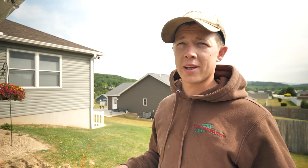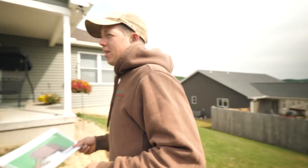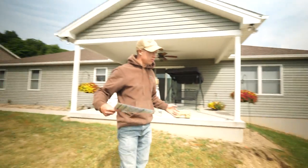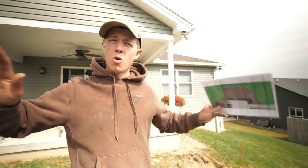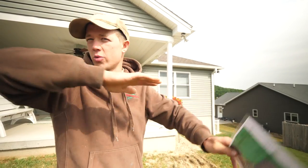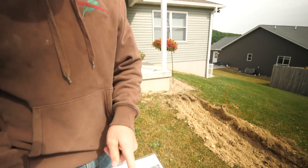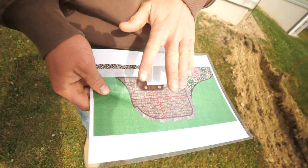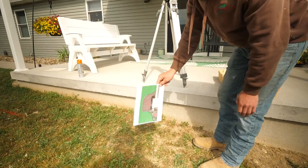If your yard is like most people's backyards, it's not nice and flat, so you're going to have to make a space to put in a patio. A lot of the yards we work in look like that — there's hills in them. In this case, it falls off steeply here. Oftentimes we either end up building a retaining wall to hold back a bank so that we get a nice level spot. In this case, we're going to end up building a wall around the outside perimeter to bring up the patio to get a level space, with one step coming off of here down to the patio.